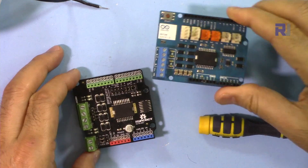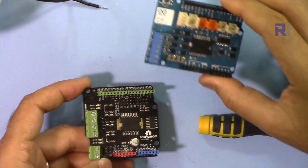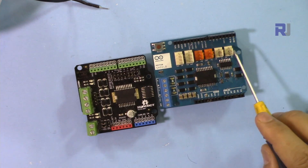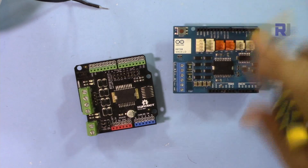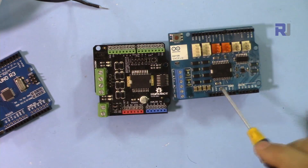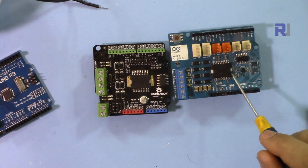This is the official Arduino motor shield from arduino.cc — I have a separate video explaining it fully, link in the description. Comparing the two: the DF Robot shield is more compact. It also has extra pins for connecting other sensors and devices, which is missing on the official shield. The official shield has a reset button accessible from the top; on the DF Robot shield the reset button is underneath. The official Arduino shield has functional current sensing for each motor channel, allowing you to take action based on current draw.